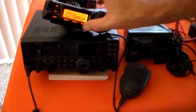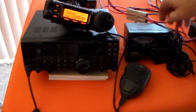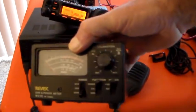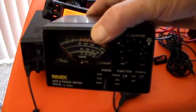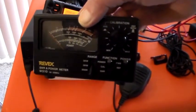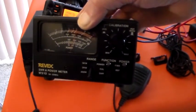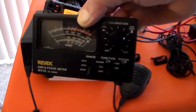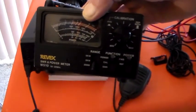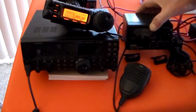Let's put it back to FM and see what sort of indication we get on the power meter. Remember where the FT450 was — it was just below the 100 on that bottom scale. Remember the bottom scale is a 200 watt scale? And this is producing slightly more power — there's a needle's breadth closer to 100 watts. So it's drawing more current on transmit, but it's producing more output power as well.